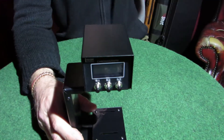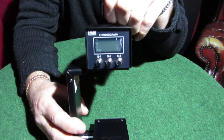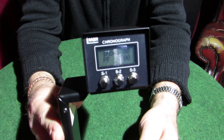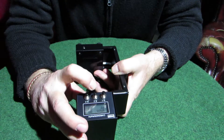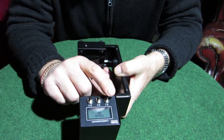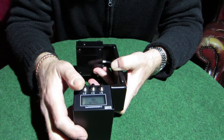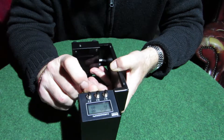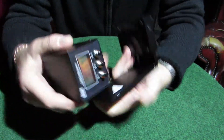I'm going to turn it off and turn it on again. When you turn it back on, that memory is not automatically loaded — when you turn it on, the machine is ready to go again fresh. If you press S2 once, you'll see no shots. So what you do: turn it on, press S2 three times, then S1, and you'll get your memory screen flash up again. If it keeps disappearing before you press anything, just press S1 again. Press R for read, which is S1 again. That should now have read what was in the memory. Press S2 once, then S1, and we have the last three shots which have now loaded back in.